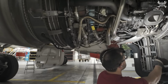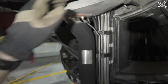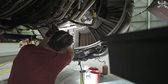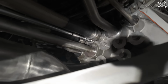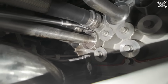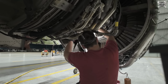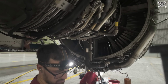Okay, now we are free. We need to remove the bolt over there, and that way we'll be able to pull the cable out. So let's remove that bolt. It's quite a long extension, but with that I can go from the back all the way there. Let me show you. From back here all the way to the bolt, and it works. So here's our bolt. The tiny link is over here. So this is how it's held in position, thanks to this and that bolt.